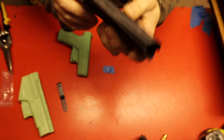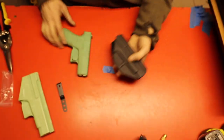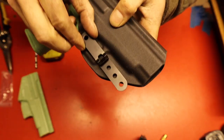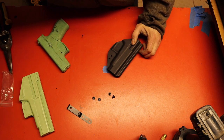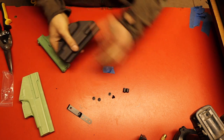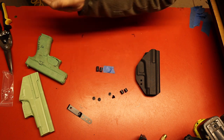I went ahead and buffed the edges — as you can see, they are nice and ground down, no rough edges, no sharp points. I just do that with a buffing wheel. Next thing we're going to do is drill out the marks we made. I went ahead and punched them so we can bolt the clip on and set our retention. We need two quarter-inch female posts, two three-sixteenths female posts, and two sets of bushings.